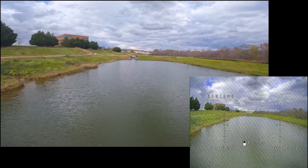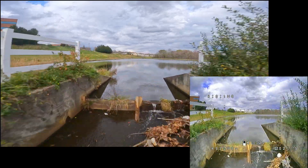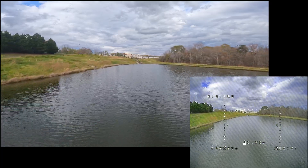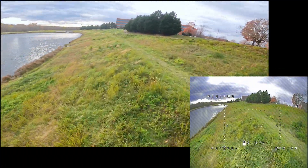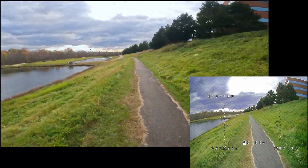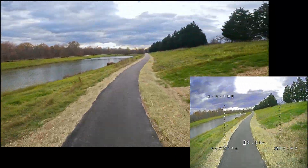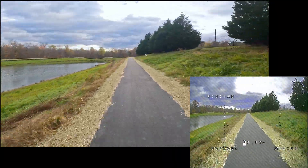I think I have to swap out one of the receiver antennas or clean out the contacts. Since I don't have a Gemini ExpressLRS transmitter, I can't really test the Gemini receiver to its full capability, but even with my little Radiomaster Pocket with its relatively weak 250mW output power, I had zero signal issues between me and the drone. Once I do get a Gemini transmitter, I really want to do some extended testing — not necessarily long range, but penetration testing around various objects like walls, buildings, and trees. I really do think this is going to be the future of ExpressLRS, since this hardware doesn't cost that much more than standard ExpressLRS hardware, so I'm really excited to see how this develops.